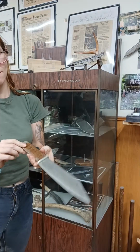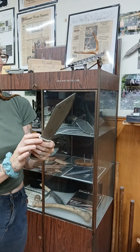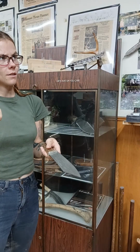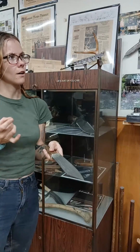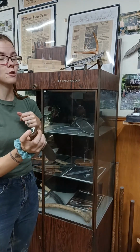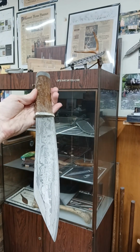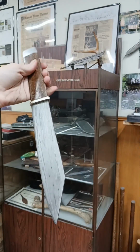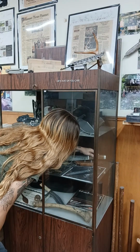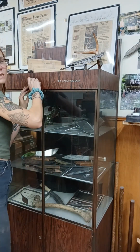And this is actually one of my pieces. That is stabilized mammoth rib bone that has the gnaw marks for an animal killed unaided. 1 full ounce of silver for the bolster. The Damascus is actually meteorite, excavated Viking relic blade, 1095 powder, and fossil Damascus, and in the bolster there's a 6.25 carat cabochon emerald put into it. And that's just a few of our work.